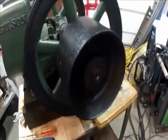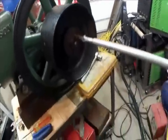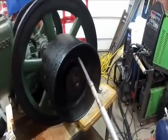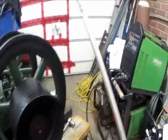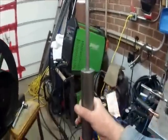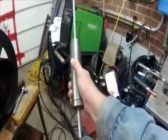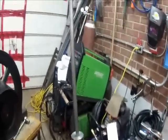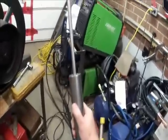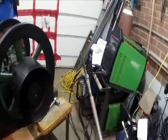It worked, guys! There it is — that's the gib key pulled out where I TIG welded that piece onto it using my slide hammer that I made up. It's just a piece of inch-and-three-quarter steel bar, bored through it, half-inch shaft. Total weight of the slide hammer — the actual slide — is about five pounds. So there's the gib key. It does work using this method. Woo-hoo!